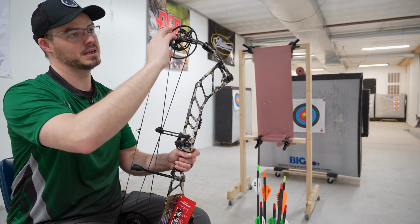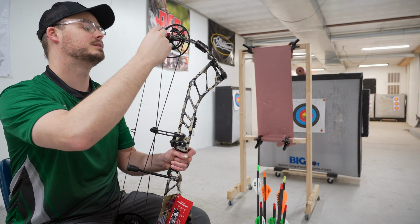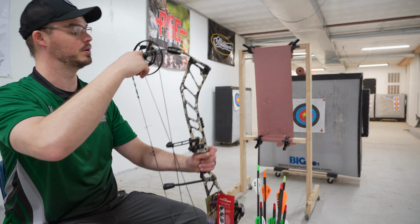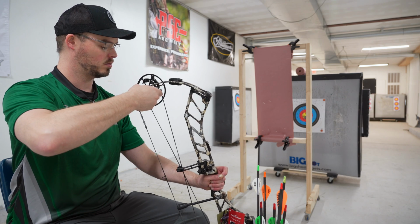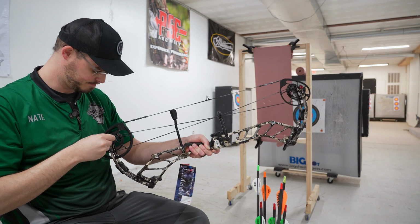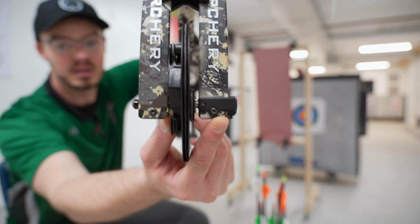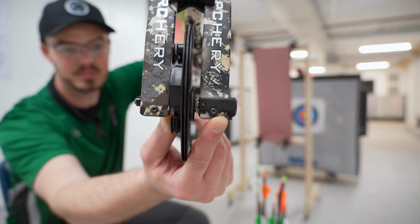And think about this, right? It's righty-tighty. So bringing it righty is gonna suck it to the right, and taking it to the left is gonna push it to the left. And you can just, of course, watch here in the sight window. So I'm actually gonna go between the witness marks here, between witness mark 1 and 2. So I've now moved it, so now in the sight window, it is now further over to the left than it was when we started, both top and bottom equally.